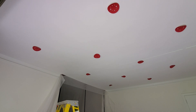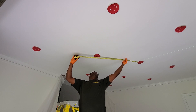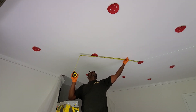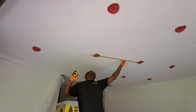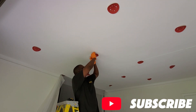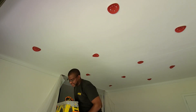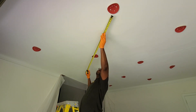Even though we've got the laser, making sure the spacing between each of the fixtures is going to be easier to do with a tape measure, as you see me doing here, just trying to make sure everything is lined up the way we want it. One of the reasons why it's a good idea to do a diagram is to make sure you're keeping all your measurements straight, because as you're standing up on the ladder, your mind can start to wander and you can unintentionally transpose or remember measurements wrong — especially when you're doing this many measurements over and over again.